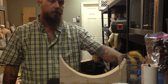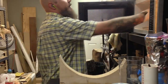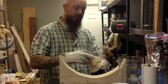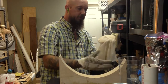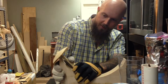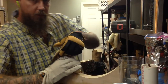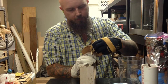We're almost at the end of the three minutes it takes to microwave. That's three minutes in the microwave with a fully soaked piece of wood wrapped in very wet paper towels. Now I'll be unwrapping it very quickly before my gloves get too wet, because this is excruciatingly hot. Believe it or not, it is steamed. Wood becomes pliable once it's been steamed — something in the lignin becomes elastic and you can do things like easily bend it, as long as you manipulate the grain in a direction where it wants to go. Then you can shape the cap. All you have to do is hold it until it cools and it will hold whatever shape you have pushed it to.